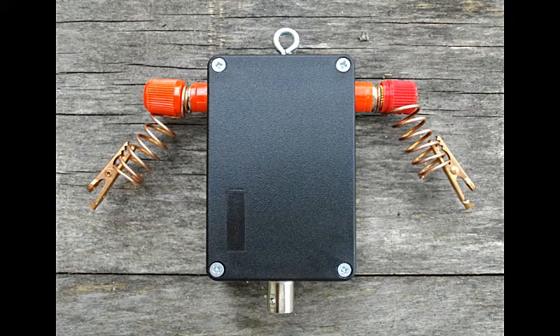I used that rounded hole to continue to crimp it down in a round configuration. I was finally able to crimp it down so small that it remained round and would slip over the binding post, and I was able to put the caps back on and tighten them down. So now all I've got to do is unroll the antenna from the fishing reel, clip those on to these springs, and hoist this balun up — and it's ready to go.